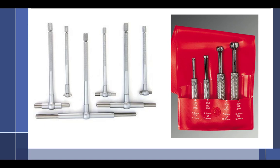All right, so what I do, and I'm doing it backwards, is I start with it at an angle. Remember, this is a very three-dimensional thing here. Number one, I've got to get it perfectly perpendicular. I have to get it in the largest part of the cylinder, and if I have it crooked at all, it's going to measure too big, right? So it has to be perfectly parallel and perpendicular, both. It's got to be parallel this way and perpendicular this way, and it's got to be at the largest apex of the cylinder, and it's got to be square.